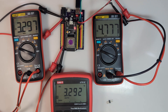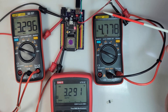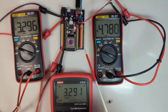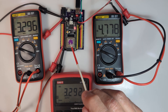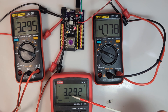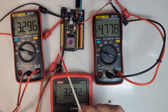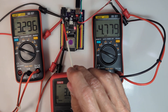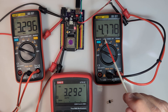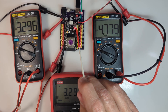I have it set up here on the table. I'm coming in with power through USB-C and I've got the jumper in the 3.3 volt position. The ESP32 is plugged in and you're seeing 3.3 volts on this meter showing the voltage at the red pins, 3.3 volts showing the voltage at the VCC pin, and then 4.8 volts showing the voltage at the 5 volt pin of the ESP32.